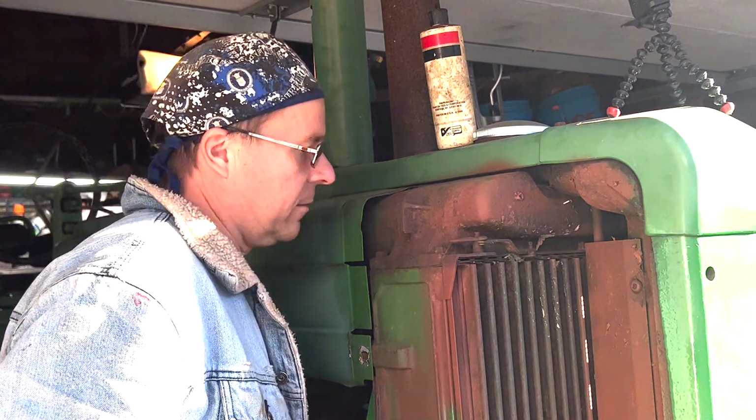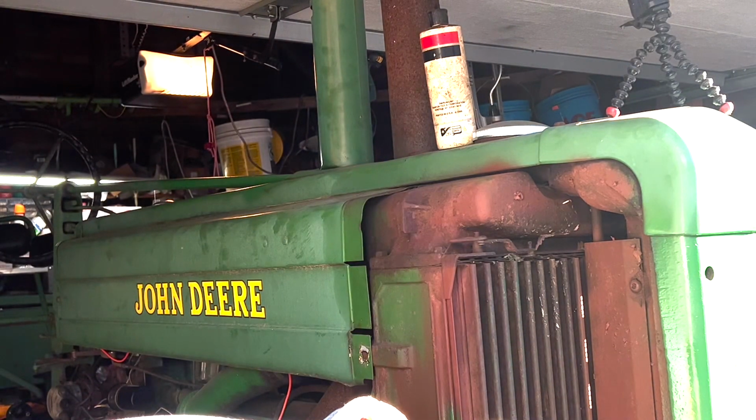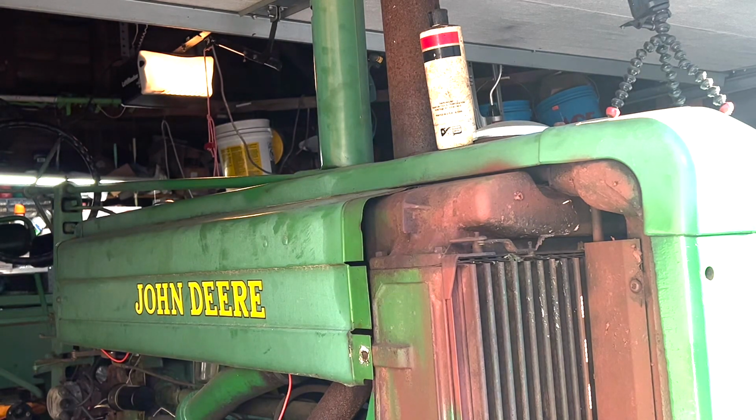I kind of want to use, I think, it might tell me here what size to use for which one. It would be good if it did, because I don't want to go too small, but it doesn't. Select correct drill size. Correct drill size for what? Drill in reverse, yep, I know that. Drill hole in center of broken screw, use tap wrench, turn the extractor counterclockwise. Which I do have tap wrenches.